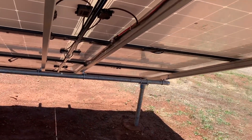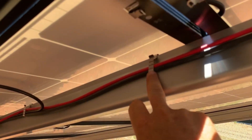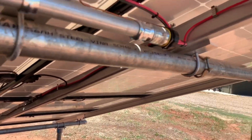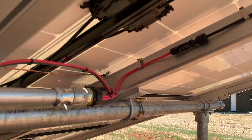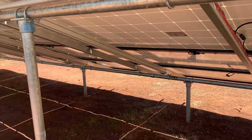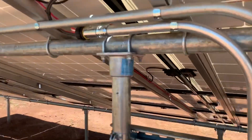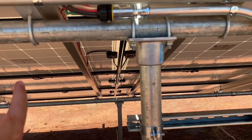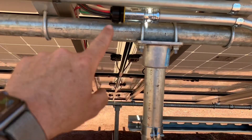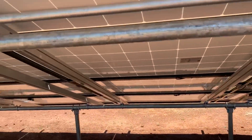Another thing I like to do to keep these clean is these right here — these are PV wire clips from Wiley, they're four-wire clips. This really allows me to keep my ground mount super clean, and color coding everything keeps it even easier to understand. On the right-hand side the negatives are black; on the left-hand side the negatives are white, because I had a couple instances where I had both strings coming out in the same row. This side is string A, the left charge controller; this is actually the right controller string B — that's why we have different color wires to help identify what's going on.